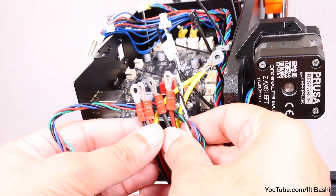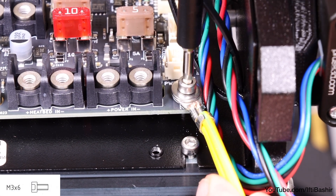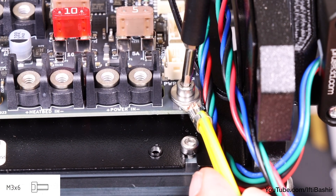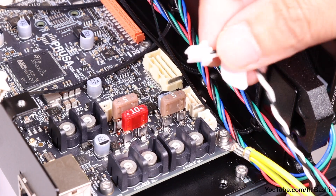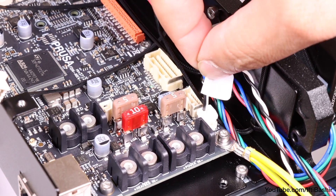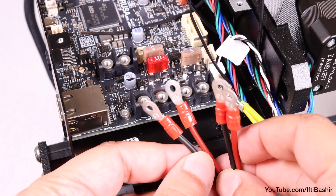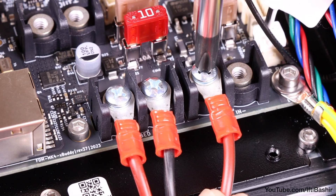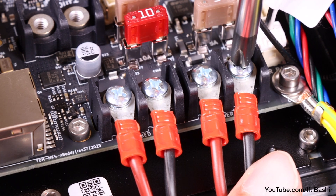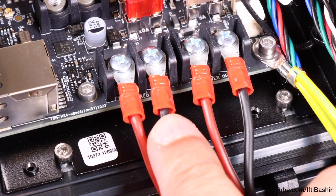Here we need to start connecting into the board. Begin by attaching the PE cable connector to the right lower screw hole in the X-Buddy box — be careful with orientation, as the flat side of the connector needs to lay flat on the board, using a single M3x6 screw with an M3 washer in between. Tighten the screw firmly, making sure to guide the cable so it does not interfere with the threaded hole under the electronics board. Connect the power panic cable next to the white connector on the bottom of the X-Buddy board, just above the previously installed cable, before moving on to the four power cables. These have circular connectors, so the screw will pass completely through. Using the supplied power terminal screws: red, then black, then red, and the final black — making sure all terminal screws are firmly tight. As with the power supply, double-check to ensure cables are installed in this orientation, as incorrect wiring can cause major damage to the printer.